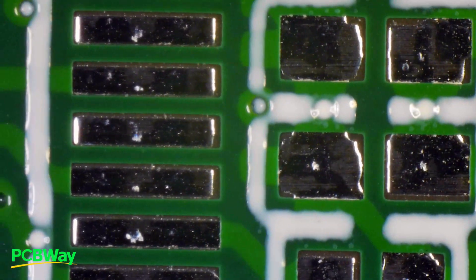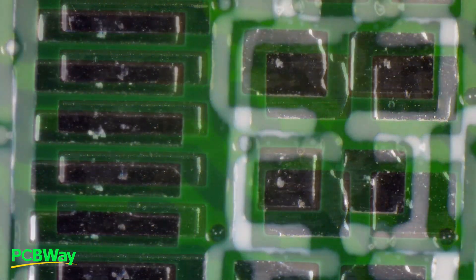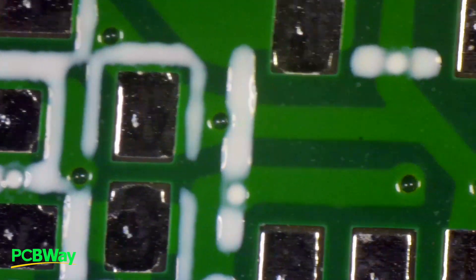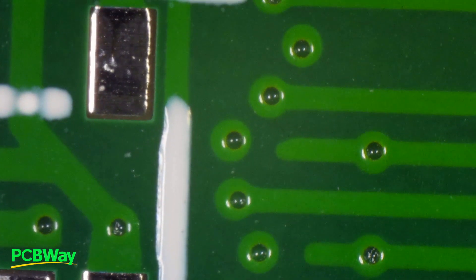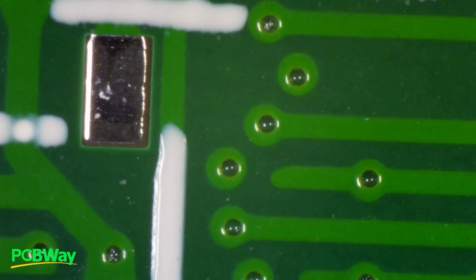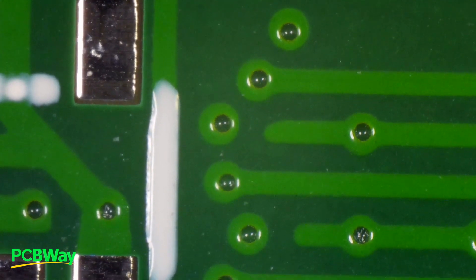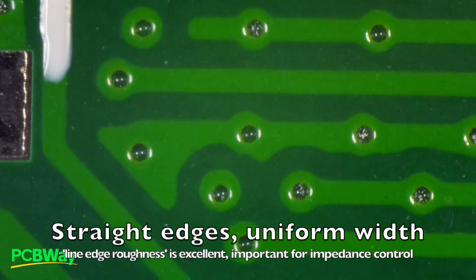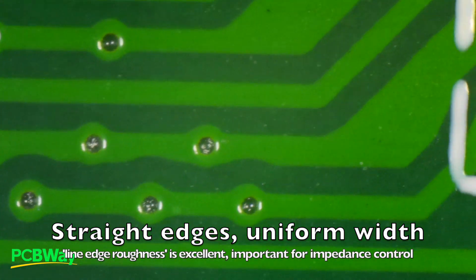This is an area of a lot of congestion in the design, so that's why I'm looking into this area. Some of the vias have been filled with the ink of the silkscreen, which is nice. There are more vias — some of the return-path vias that are not connected to anything, and the normal signal vias — and again, everything is pretty regular, pretty well centralized. All the traces have clean edges, not jagged or uneven. So yeah, I'm pretty happy with this.